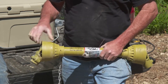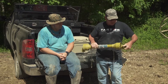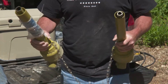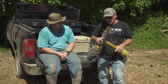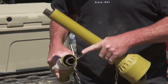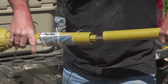What we're going to be doing is removing the plastic shielding off of this. This is a protective shielding to help keep you from getting caught up inside. The PTO actually spins inside the plastic. We'll take off the plastic, separate them out, cut off the set amount we need for our tractor — it has to come off both sides. Then you'll need to cut off that much of the plastic section off each side, and that keeps it so that it moves back and forth properly.